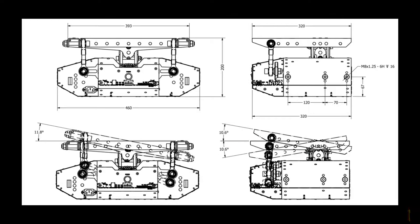There are 2 motor driven arms at the front that facilitate the movement across 2 degrees of freedom, or 2 DOF, and they move around or about the universal joint situated on the top in the middle of the unit supporting the cradle, which bolts onto your seat, or seat rails if you have them.